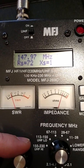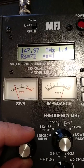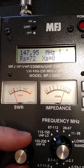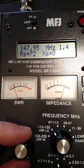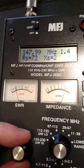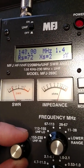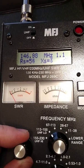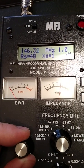I've never transmitted at the top of that range, so I don't know how the transceiver will handle it. Most of the new ones have an overload feature that will cut the transmitter off or kill the power to protect it. It's pretty high impedance at the top of the two-meter bandwidth, but going right back down to the middle of the band, I mean — you couldn't ask for anything better with that J-pole.